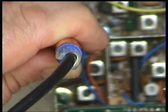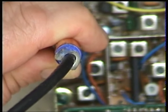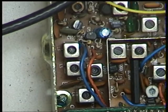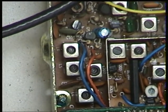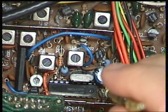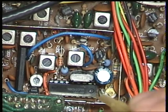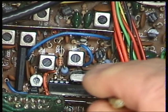We've now peaked those coils. We'll now make sure the frequency is on using CT201 — there's CT201. We're on channel 20, so it should be 27.79125 MHz, which it now is.